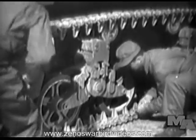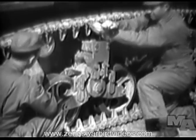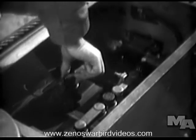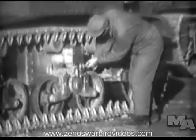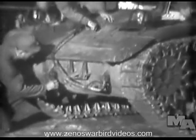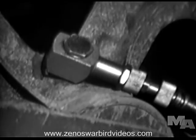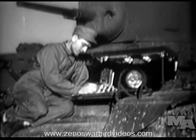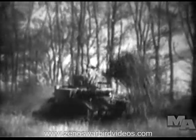Aside from routine inspection, there are also duties of first echelon maintenance, in which the crew keeps the tank in good running condition under the supervision of the tank commander. This includes tightening nuts and bolts, cleaning the machinery, and care of the battery, tank tools, and guns. The tank crew also works under the supervision of second echelon maintenance personnel, where the crew removes armor plate, changes oil, greases certain parts, and performs track maintenance operations. Oral and written examinations are generally included in tank driving instruction, and at the completion of the basic part of the course, the student must pass a practical examination in driving before taking up the more advanced work.